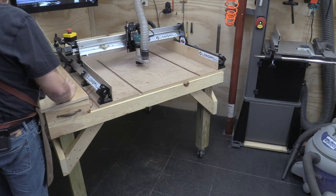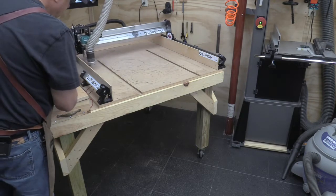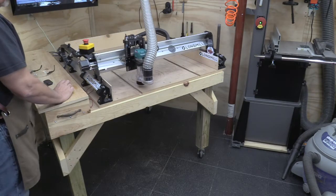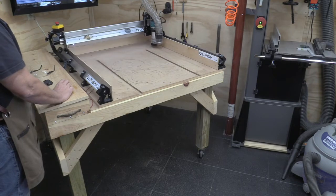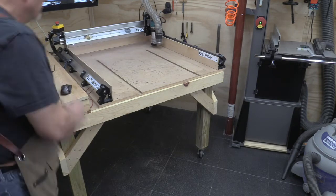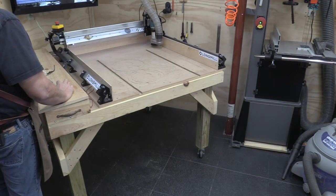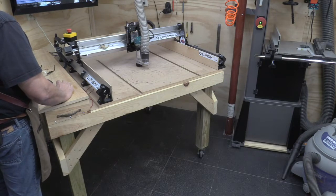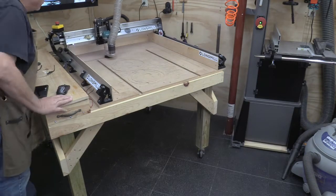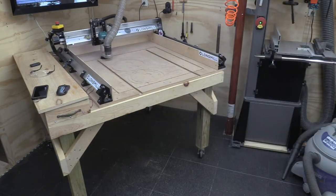And here's a tip for you. That center could come in handy down the road. So what I did was I put a hole in the center of the board. And what you're seeing me do here is G-Sender has an outline feature, and I wanted to run the outline just to make sure that my extents weren't challenged there. The mill would go where I want it to go. And then basically just get everything ready. The machine goes back to center and then carves the wasteboard out.